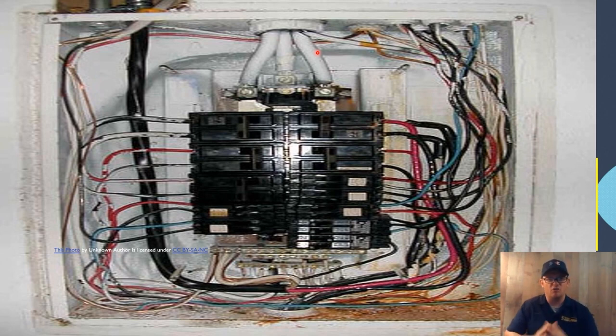There are a million different ways water can get into your home. Another one could be that you are in a heavy moisture area, like a block wall basement. That block wall is drawing that water in — in that case I've seen it rust out the whole back of the panel, completely rust the panel out. You wonder how it's even functioning at all. There can be so much rust in there that the outside cover is rusted. It can look like it's almost growing inside there — kind of crazy looking. There can be so much oxidation and water just on the outside of the panel that it has nowhere else to go, and again, that change in temperature. Let's say this was a block wall behind here with lots of moisture — it could be running water during heavy rains. Then you have temperature controlled on the outside of this panel, creating just a moisture barrier.